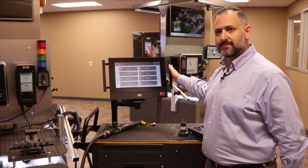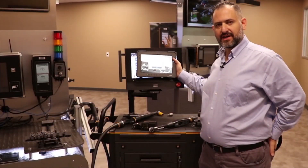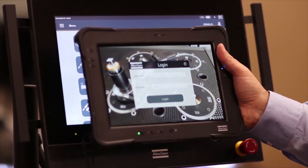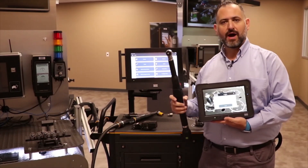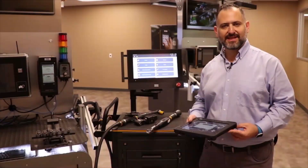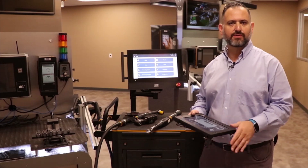Customers can choose to have either the configuration with a PC or the configuration with the new ST pad in place of the PC. ST benches configured with a docking station for an ST pad give the highest possible level of innovation to our customers in terms of Industry 4.0. ST pads can be undocked from the bench itself and then used in conjunction with an ST wrench to run residual torque tests, or we can do additional tool testing with an external IRTT connected to an IRC connector. Visual inspections can be run from the screen of the ST pad and the ST bench, and operators will be guided through the entire process with picture guidance on the screen of both devices.